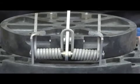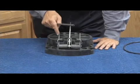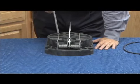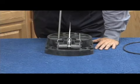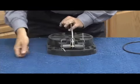to get the disc holder. You'll need a small piece of 1/4 inch tubing. I use stainless steel for strength. I know some people say a hollow nut driver will go over here, but you can see what I'm going to be doing is I'm going to be placing it over this spring piece that's sticking straight up. It's sticking up 1.5 inches on purpose because I want to use that for leverage to pull the spring down, push it to the side, and release the spring tension.